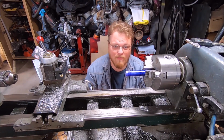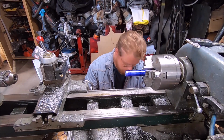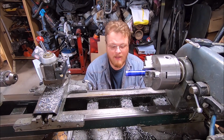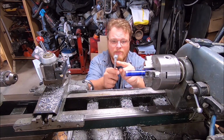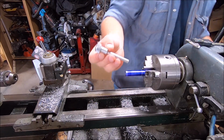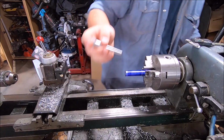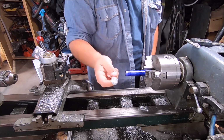The W2 valve covers, it's not your typical Mopar Performance valve cover. It has an Allen head bolt that goes straight through. It's a wide valve cover. And I made this. This slips through the valve cover. This seats down on the flange. And you use this knurled section to tighten it down. And then you put a stud in it, which is one of these that sits up in there about yay much.